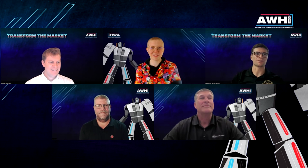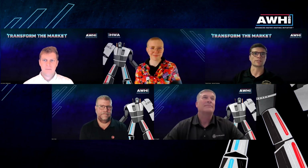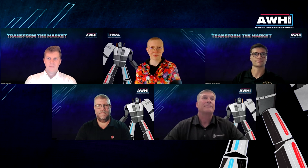Yeah, I'll piggyback off what Dan said. We would also, as installers, recommend the 240s if it's an option. In the Bay Area, we do have a lot of older homes that have 100 amp panels. So it's given us an opportunity to still offer electrification. Just to steal one of Joe's numbers, I'd say we're probably looking at currently about 20% of the heat pumps we install are plug-ins. Just because they actually work and they're great options, we can still offer them. But when there's the opportunity to do the 240, we will.